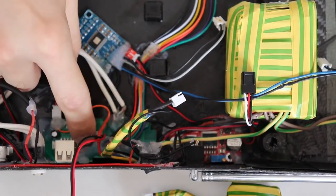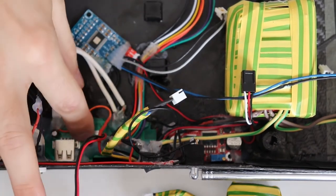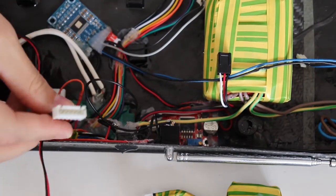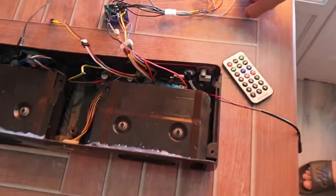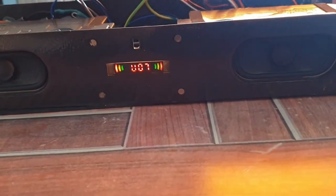And from this board, I've actually soldered these cables to extend the screen to the front plate. And I did the same with the microphone and the buttons, which go to these JST plugs and then to the relays. Speaking of buttons, here are the touch buttons that I've used and how everything looked before it was mounted and covered in hot glue and tape.